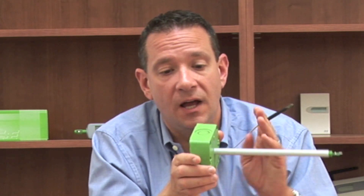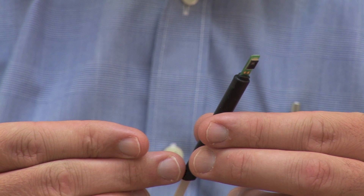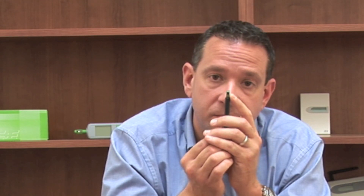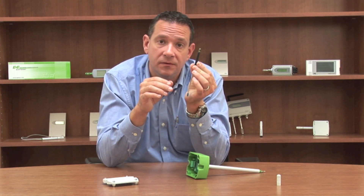The sensor inside is attached to a ribbon cable. This sensor has a hot melt covering the electronics, and the only part exposed is our humidity and temperature sensor. This allows it to be in a harsh environment with near condensing conditions while protecting the electronics because of the hot melt.